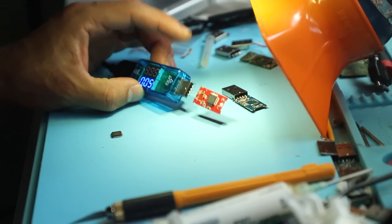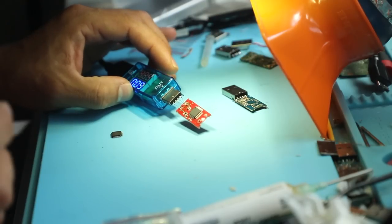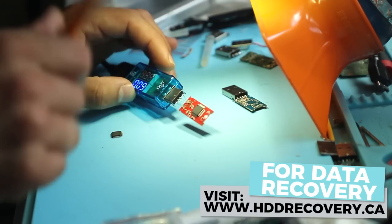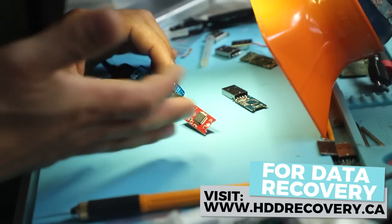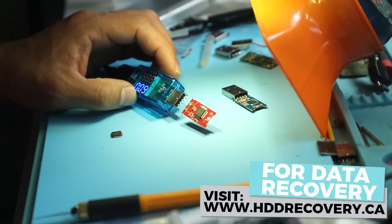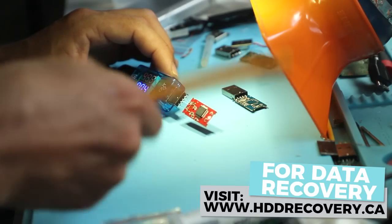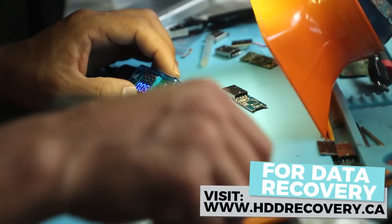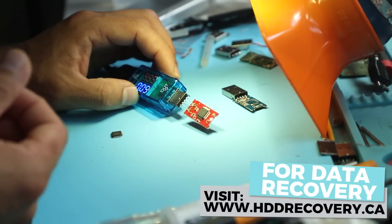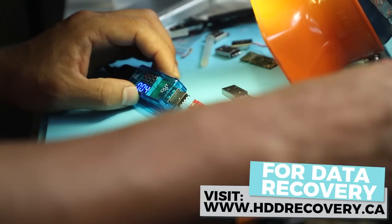Number one is we can repair our failed unit by swapping the controller that is deemed to be functional onto a device that's non-functional. Aside from that controller, I really don't see a problem with our original device at this point. But what are the risks? We always have to evaluate our risks. The risks are that if this controller is programmed slightly differently or something like that, if we get unlucky, it could potentially kill the data on the original unit, right?